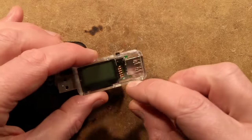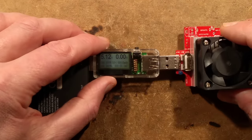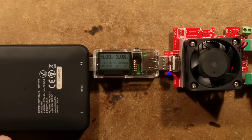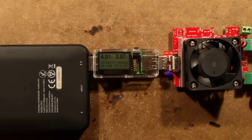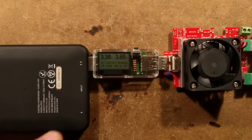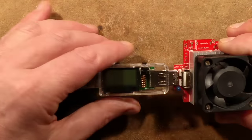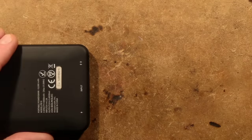It's going up to 3.8 - it cuts out at about 3.5 amps. Useful to know. I can also test this little resistive load unit. This is saying 3.08 amps... 3.4... 3.6 - that's interesting. This one's not cutting out, now up to four amps, and the voltage is still holding about 4.9 volts. The voltage suddenly dropped - that's probably what cut it out before. So it is around 3.5 amps that it cuts out. Good that it delivers that without dipping.